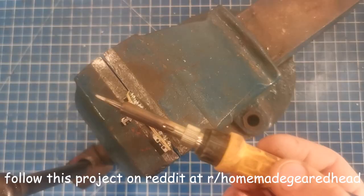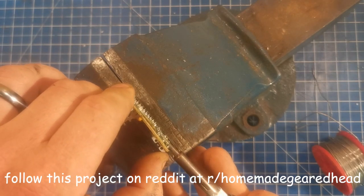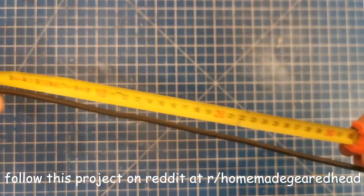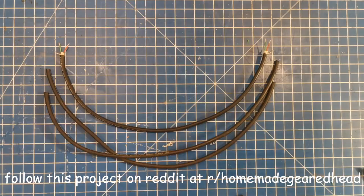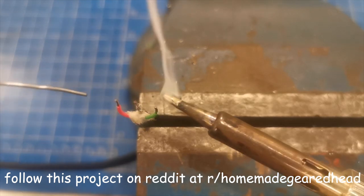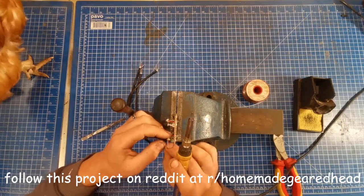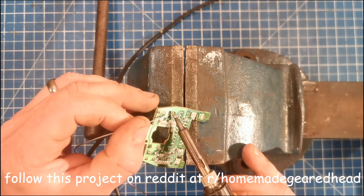Once it's fixed down, it's time to move on to the buttons. If you haven't done much soldering before, here's a couple of hints. Removing components from a circuit board can be a pain without the right tools, but since there are only three pins on each button, there is a shortcut — hold your soldering iron across two pins at the same time, going backwards and forwards, and you'll be able to twist the components off. Cut yourself three cables and strip back the ends. You'll want to tin the tips, which involves coating them in solder and makes your life easier later on. Make sure you heat the copper wire a split second before you dab the solder on, or else the solder will just sit on the surface. To push the tip through the hole in the board, I prefer to just melt it on the back of the board and push the tip through. This all needs to be done quite quickly — if you keep your soldering iron on the board for too long, the pads might start to lift off. If it doesn't work straight away, just stop, take a breath, let it all cool down and then try again.